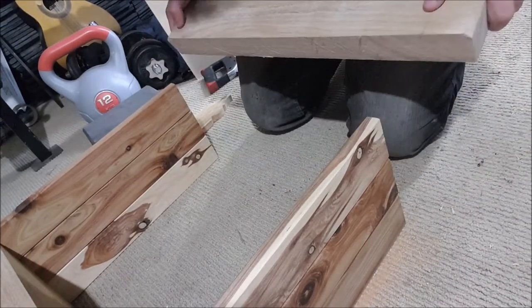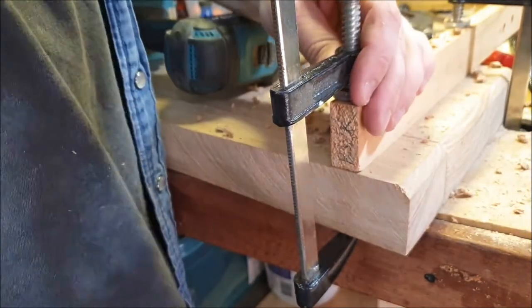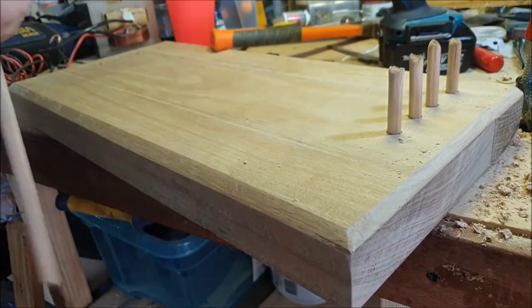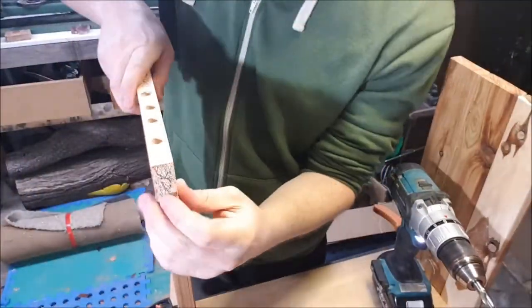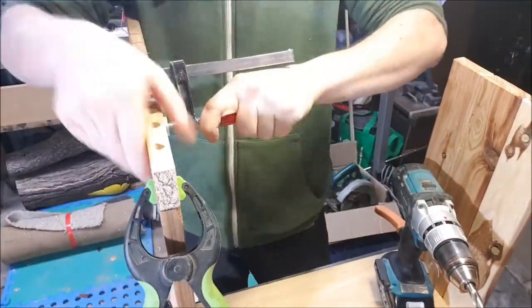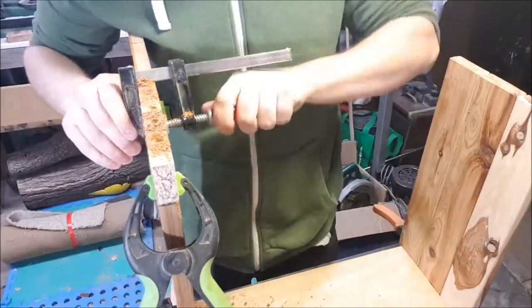Rather than try to measure where the base lined up, I figured I'd just use the shelves as a template themselves. This dowel guide I made — it's the same bit of wood, with the holes in the other end — but I needed these holes to be pretty much dead-on vertical. So I didn't hand drill them; I snuck around to dad's place and used his drill press. Those holes were really good. I rough cut the dowels to length through a bit of testing, and this was the reason I wanted these holes to be vertical — I needed them to go straight in the wood without blowing out the side. The drill bit went right in with no problems at all, no tear-out. It worked perfect.